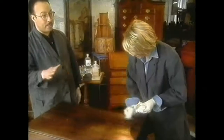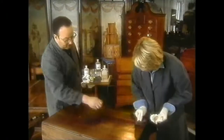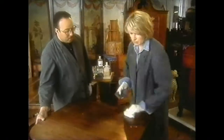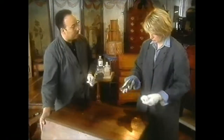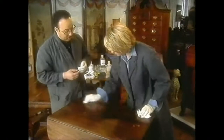All that's coming off is the dirt and wax, and the only thing left will be any part of the old finish, which we might call original — though sometimes the piece has been refinished at least once. In this case, we have plenty of the old finish left. You see all these wonderful marks — we want those because that's the history of this piece. When you know the finish can be restored, it's best to save it, and this is the safest way to clean it.